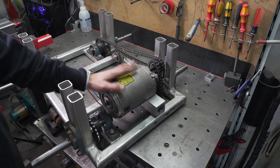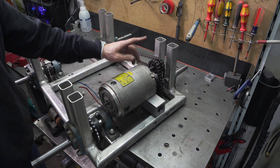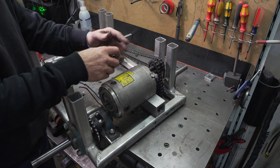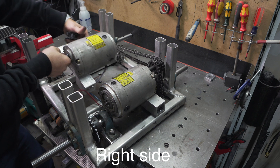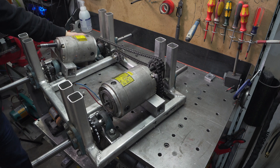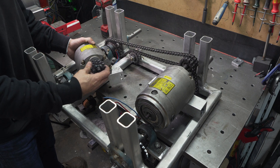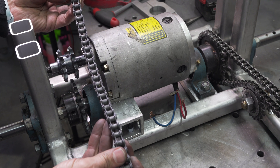So this is what we got so far — I finished one side. We have this 24-volt geared motor that will feed the left side. The gearing is a 13-tooth sprocket going to 26, so that's a two-to-one ratio. I'm going to do the exact same thing to the right side with another identical motor. I'm using number 40 chain for the drivetrain.